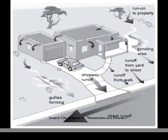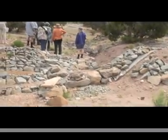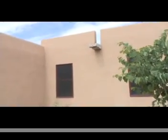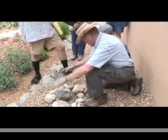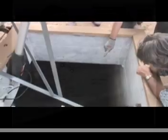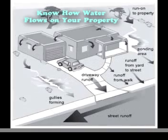For instance, we have a gully that comes down behind the house. It used to come straight down here into this little river. The house is here now, so that flow has been forced to go along the sides of the house. We've steered it so the majority flows behind, and you'll see where I have two catch basins right in the path of the flow. Everything we've done here with water catchment off the house can apply to any house, regardless of your location.